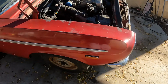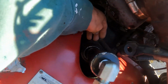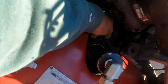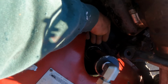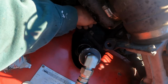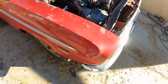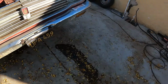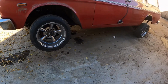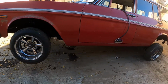I had to fix those coil cups yesterday because the other cups I had were inside of here and they started pushing through this, and I just knew they were going to start moving, making this thing move or do weird stuff, so I didn't want it having any pressure on this whatsoever. So I changed it to coil cups inside, and that seems to be working way better. I think it gets low just as it was, and as you can see, it still gets its full lockup, and it's just a lot stronger.